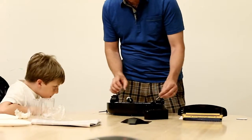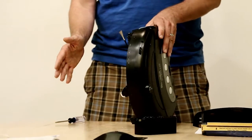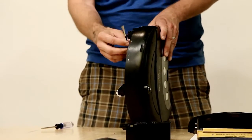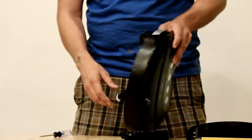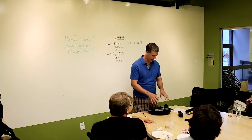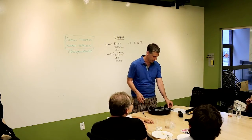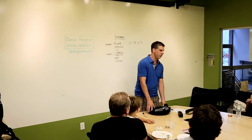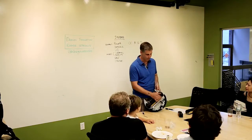One of the other big challenges was the side brush. Because the robot is round, it can't clean corners - and you should be able to clean a corner. We figured, let's stick on a side brush. The challenge is that ideally, like a street cleaner, you'd want a conical brush that's tilted to drive stuff to the middle. But with our cliff sensors, that's not going to work because it would occlude the path.